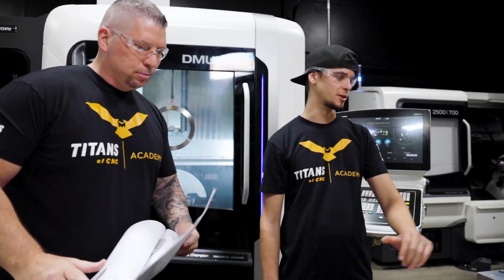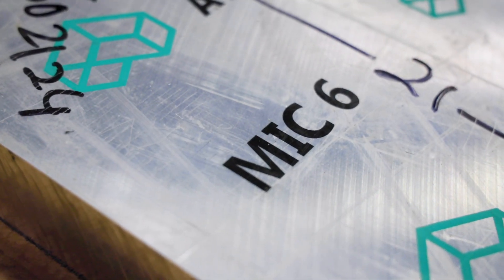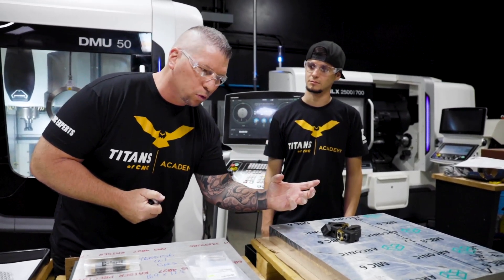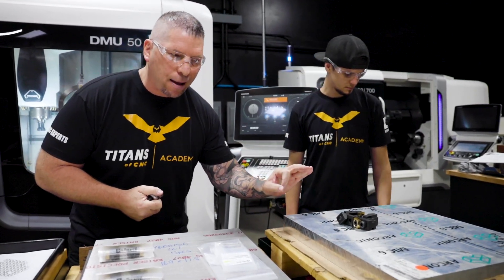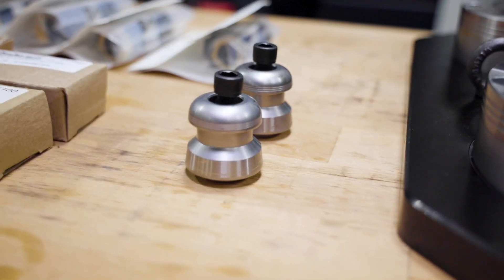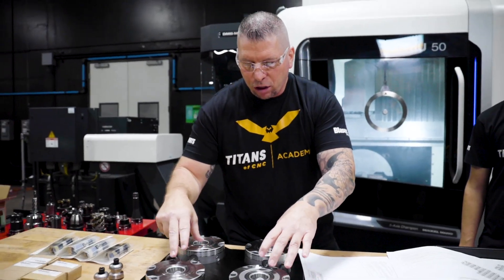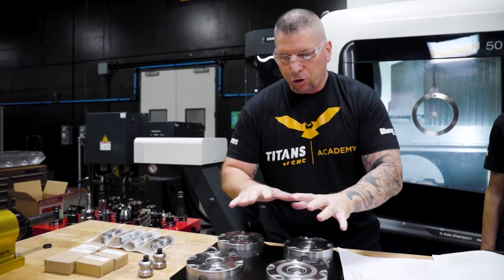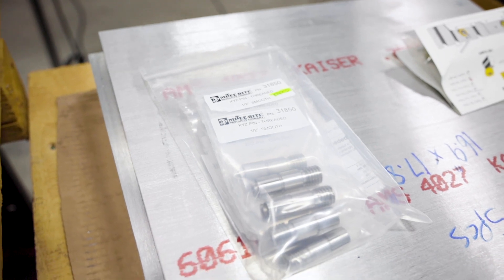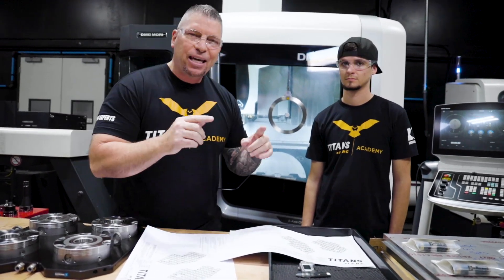Not only creating parts like this to print, but duplicating the setup easily and efficiently the second time. Over here we have our fixture plate — this is a perfect material for a fixture plate, this is mic 6. He's going to create a fixture with pins, and we're going to show you how to actually lock down a part that is very difficult to hold. We'll show you the techniques and tricks to machine that part perfectly in tolerance. The fixture is going to have pins on the bottom, and you'll be able to duplicate the setup simply by taking the fixture and putting it into the Schunk vise. We're going to show you all the different pins, expansion pins — everything you need to actually machine this part perfectly.